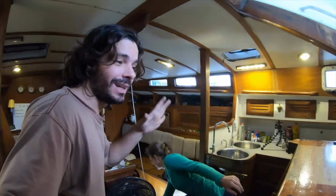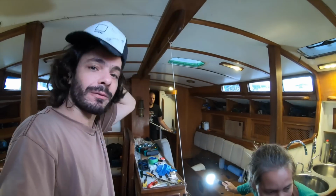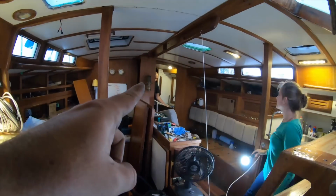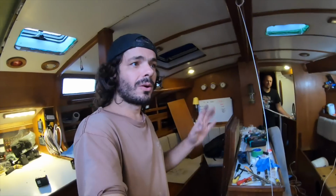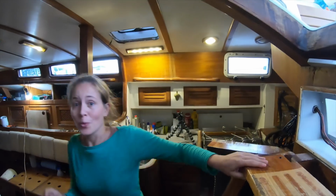It's a mess. It's always tricky in these moments. Now we're just running around and checking if we have leaks. Fred was afraid that the pump wasn't turning off, and the reason for that is because there was air in the water heater, the hot water tank. And now that we open the shower, the air from here is going there, and now we are filling up the tank that's like 20 liters. Okay, done. Was it just air?